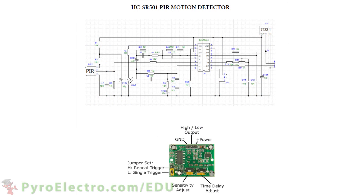Here you can see the backside of the PIR motion sensor and the schematic of the PCB. The 3-pin connector is here, the two adjustable trim pots are here and here, and a jumper is connected here telling the sensor to trigger only once when motion is detected.